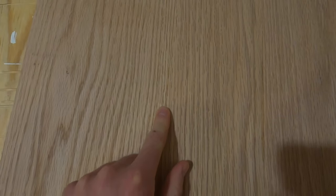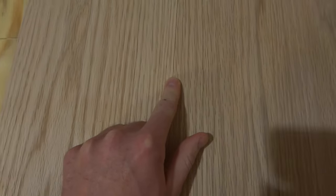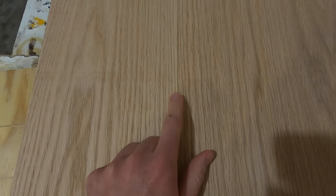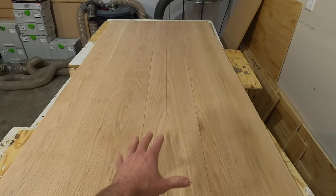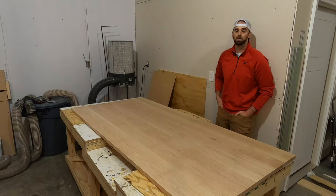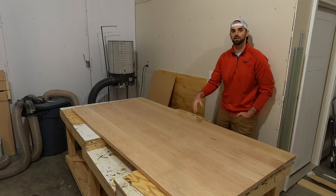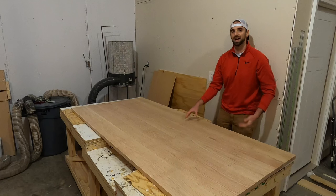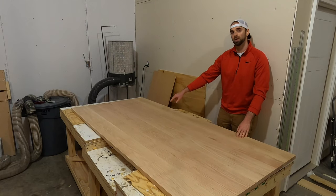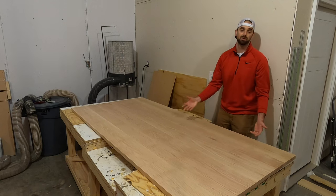Right here is one seam and I would call this a good seam — you can see that there's almost no separation or very little separation. Now if we go over here you can see the huge gap here, here, and as well as here. I'm not sure what happened — either my jointed faces weren't flat, or the dominoes prevented this thing from clamping up together, or maybe I just didn't have enough clamps on. Regardless, that's not acceptable. I thought about just leaving it, or trying to fill it with wood filler or sawdust and glue. My concern is that the stain I'm using might not penetrate that glue or wood filler, so where I filled in that gap maybe it wouldn't stain and I'd have a glue streak on the table top, which would look even worse than leaving a gap.